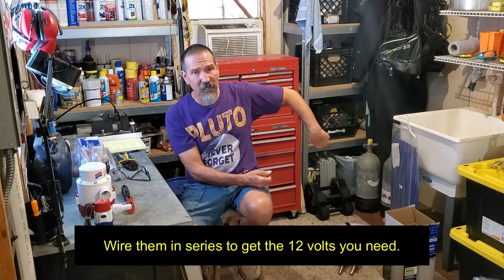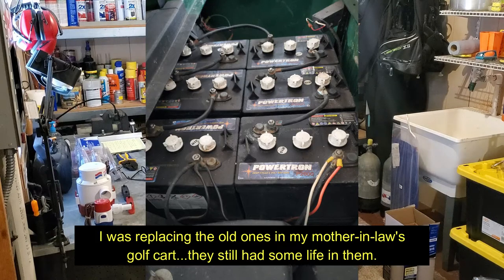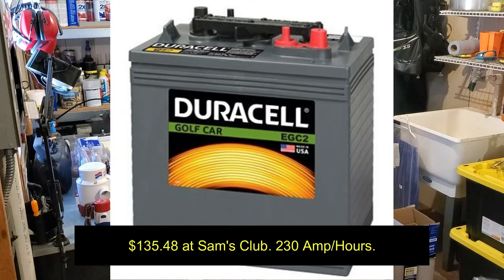What I found is those boxes are just big enough that I can put two 6-volt golf cart batteries in there and have 225 amp-hours when you hook them in series — that's a pretty good start. I'll have a separate starter battery later, but first I'm just going to go with these. I had some used batteries I was going to put in there from redoing my mother-in-law's golf cart, but with the boosted budget I'm going ahead and getting fresh batteries, because if I'm going to put those big 60-pound batteries in there I only really want to do it once. Golf cart batteries tend to last five to six years in these types of applications.